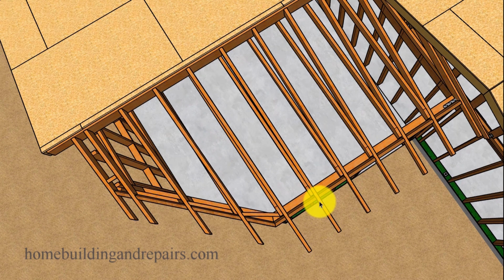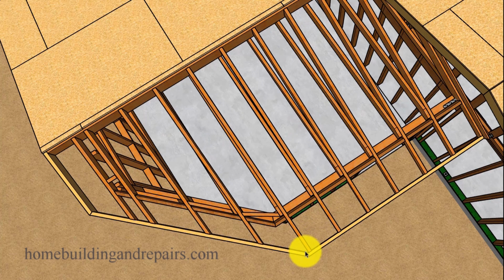Now let's go ahead and take a look at our fascia board. We're going to have a 2-foot overhang here, and then for the gable end we have a 12-inch overhang, and I'm going to have a 12-inch overhang coming off of here. You could always have a 12-inch overhang, maybe an 18-inch overhang, and a 2-foot overhang. There are no specific rules for something like this. You just have to make sure that the rafters and the fascia, the cantilever, will actually support the load that would be transferring from the overhang to the building. So that gives you an idea here.